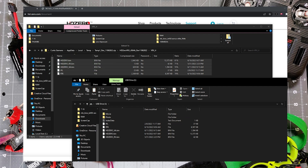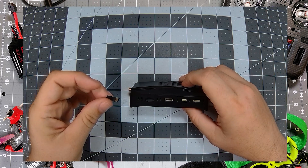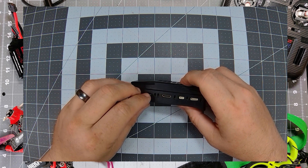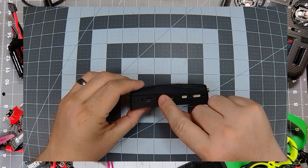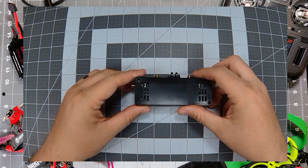Once you've ejected the SD card, take it out of the computer and head back over to the goggles to continue the process. The first step is to insert our SD card since we just put the firmware on it. Then we're going to start manipulating a physical switch — you can kind of see it in there inside the VRX.